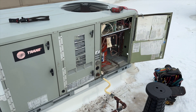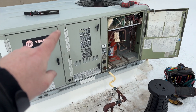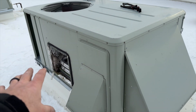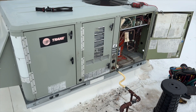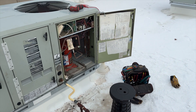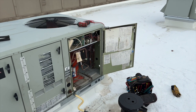She's been running for about 15 minutes now — she still stinks. All that smoke was from the oils burning off, which happens with a new heat exchanger. You want to burn that off, which is why I have the back panel off. Once the smells dissipate I'll turn it off, put everything back together, and run it inside just to make sure it doesn't overheat. It's definitely got my hands nice and warm up here. Anyway, hopefully this helps you out — thanks for watching, make sure to like, subscribe, comment, hit that bell notification, and follow me on Instagram and Facebook.